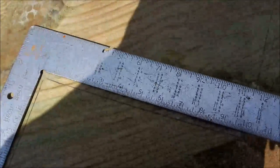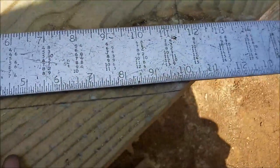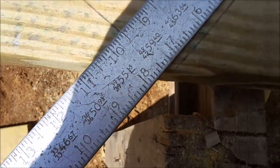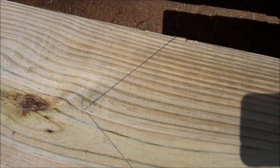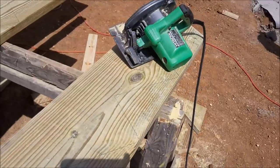What you wanna use is a framing square. Minimum on the run is ten inches — that's what we made these. The rise is calculated to be seven and three-sixteenths. So you just get your marks and advance the lines up through there. On this set of stairs, there's no special cuts at the top or the bottom, so it's pretty easy to lay it out.